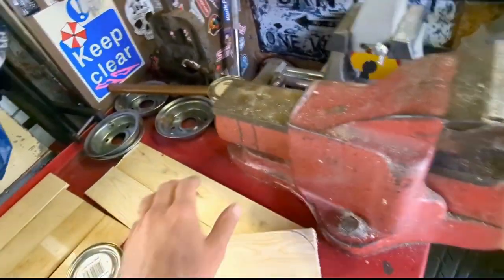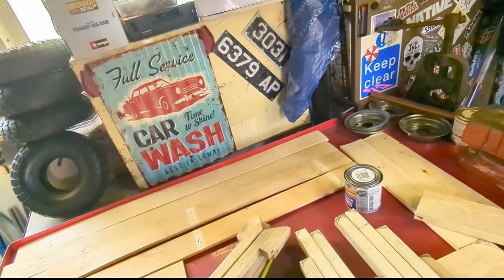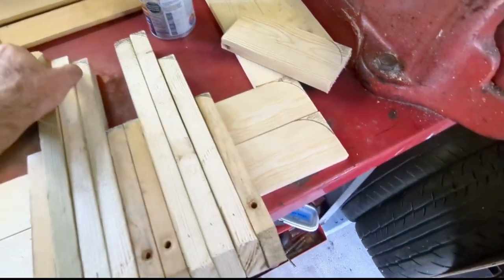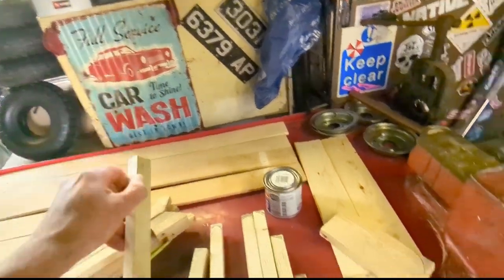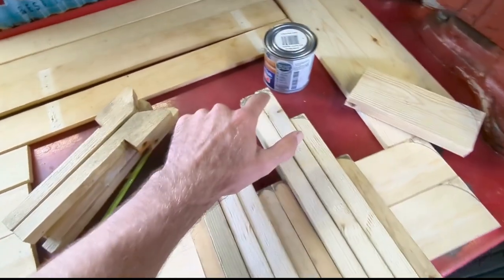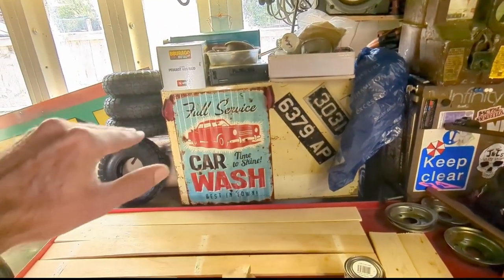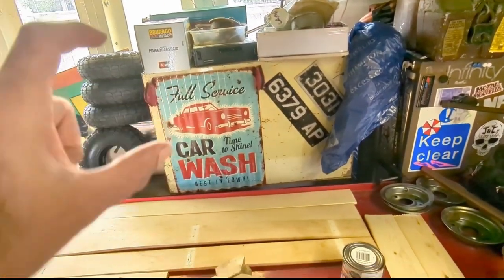You can also see here, I've cut the wood to different lengths. This is for the third and the fourth layer that I mentioned at the start of the video. To support those, I've also made a lot taller stays. So these bits on the side will now encompass three or four bits of the side slats on the edge. What I've also done is just made sure I've got enough, and I also want to give these a bit of a radiused edge. I think when you're looking at the cart itself, it will look nice to have that curved edge. It will also mirror what I want to do on the top two bits of the flyer in terms of the extra bits of wood. I want to give them a nice curved radius edge. I think that'll look quite nice.